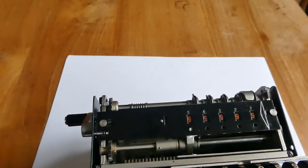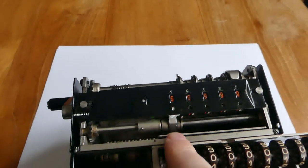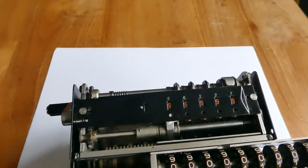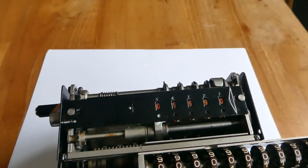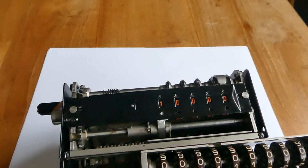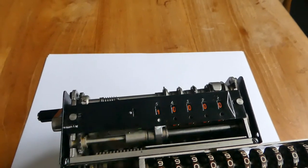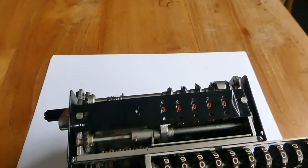And so it will also add 1 at this position, which is the current active digit for this position of the carriage. So it adds 1 to the end. And it'll also add 1 here, and now it does the carry, so it has now set it to just having done 1 turn in this position. And from now on it'll just count the subtractions.